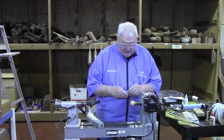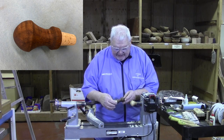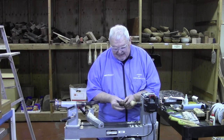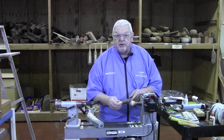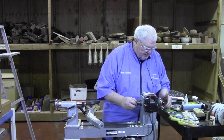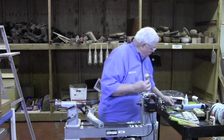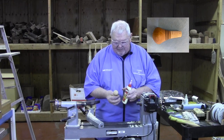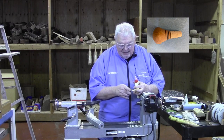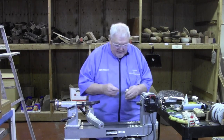You can go back and add more coats if you wanted to later. This stopper I did prior to making this video has one coat of walnut oil on it — it's walnut. After drying for a few days I went and buffed it. While it's not really shiny, it's picked up a little bit of sheen through buffing. So now we take it out of here, mount a cork on it. For glue, I generally just use a little bit of original Titebond on the cork and kind of screw it on. If a little bit of the dowel protrudes through, maybe hit it with a little sander on the very end to make sure the two surfaces are matching and smooth like this.